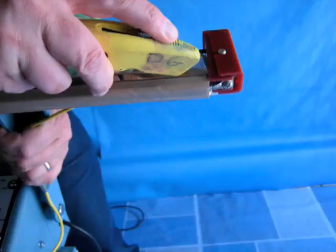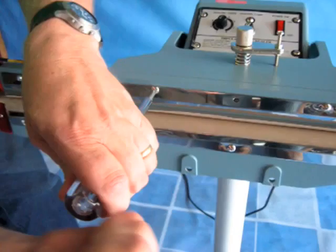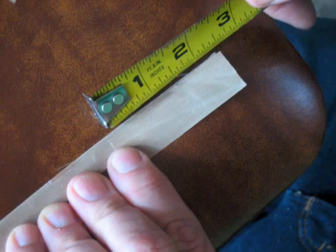A quick and easy way to obtain these scraps is to use a box cutter knife to cut the sheath along the edge of the chrome binding clamp on the front of the top jaw. This makes a strip of sheath material about a half inch wide. Use the knife to cut four two-and-a-half inch scraps from the strip. These scraps will be used later on.